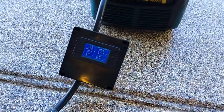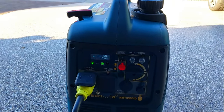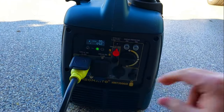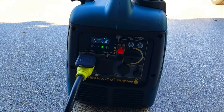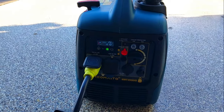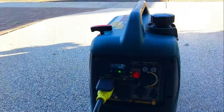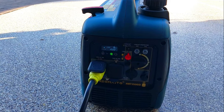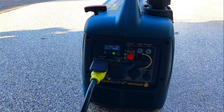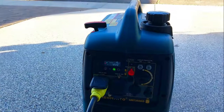Got an eco right now. 0 watt draw. We're going to turn off eco mode. Now we're going to add in 1500 watts of draw. Handle it like a champ. I've got these little heaters here and they surge a little bit. So we saw it surge up and now it's dropping back down. 1.5 thousand watts. 1.5, so they match really well.